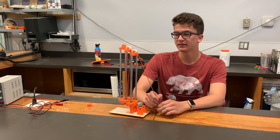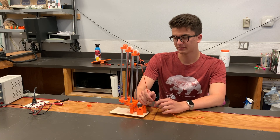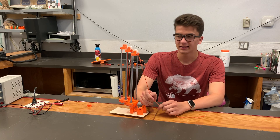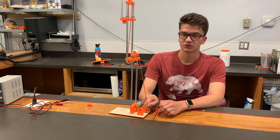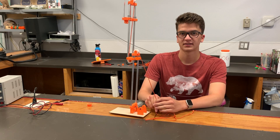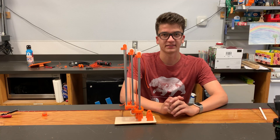For a lot of rookie teams, this is a good slide to use. It's fast to make and it's pretty simple compared to some other slides. It has some drawbacks though, like the amount of string it takes to be able to lift, which generally means it can't lift as fast. The next configuration we'll look at is what's known as a cascading slide.